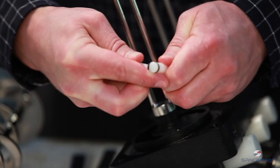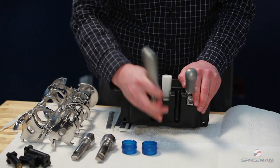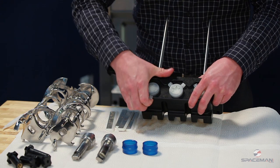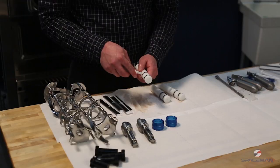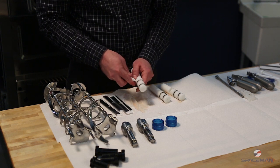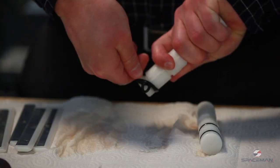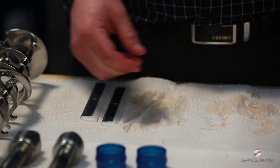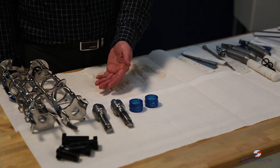This tool is the easiest way to get the O-rings off. Unscrew the retention nut, pull out the retention pin, and remove the handles. Flip the discharge door over, move the tabs, and pull off the star caps. Push out the valve bodies. Grab your O-ring tool and remove the O-rings — start with the back one first, otherwise the front one will fall into the groove. The H-ring goes into the middle piece and stops the two products from mixing; be careful not to break it when you pull it off. Remove the metal clips from the scraper blades, as product can get stuck between the blade and the clip. The remaining pieces do not require any disassembly.